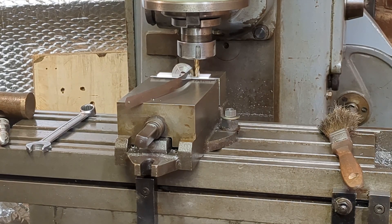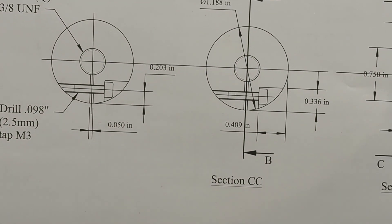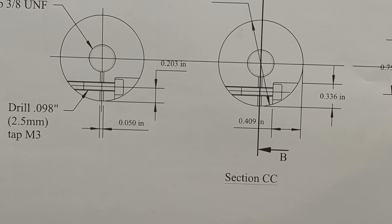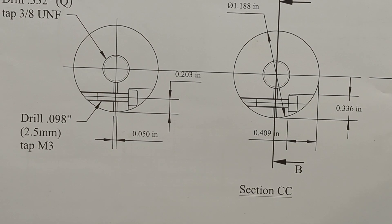I've put the nut now in the mini machine and I'm just touching off on the side and the top, ready to cut the slot in the right position. I've got some dimensions here to guide me and then we're going to drill and tap that for an M3 socket head cap screw. After that, we will slit the nut with a 50 thou slitting saw and that will complete that component.